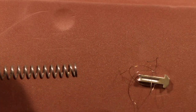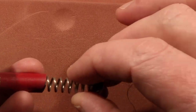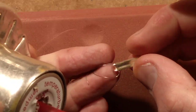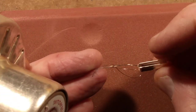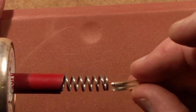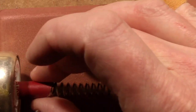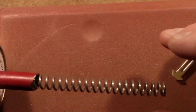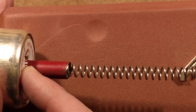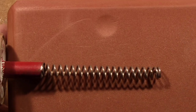Here's what I found inside after dremeling the end cap off. There's the cap, and the pin has gone inside, but here is the spring. The spring was held in place by what looks like fuse wire, which it probably is. That fuse wire was threaded down the middle of the spring and pulled the spring down under tension. The plunger probably punches through this cover label when released.